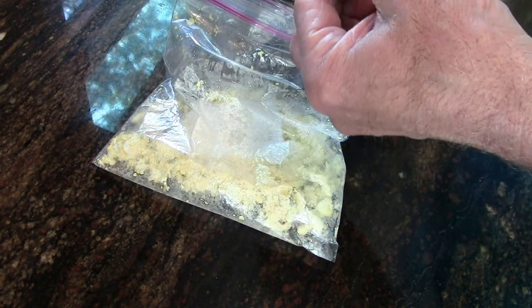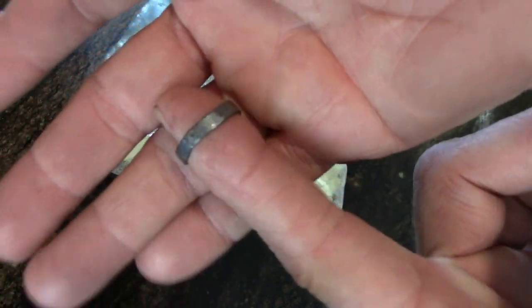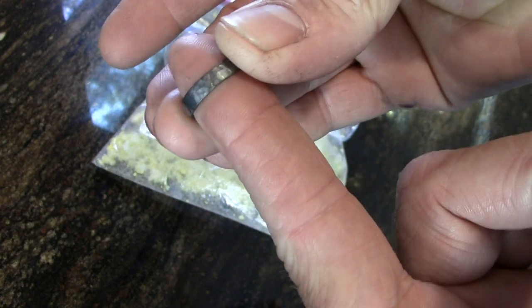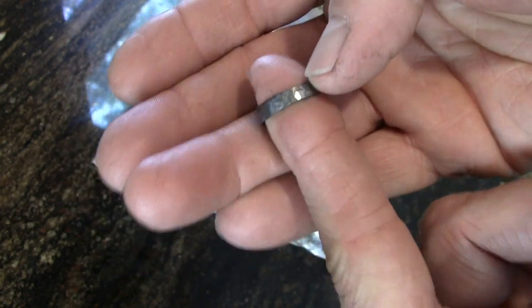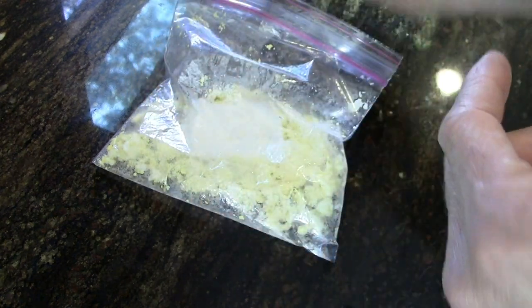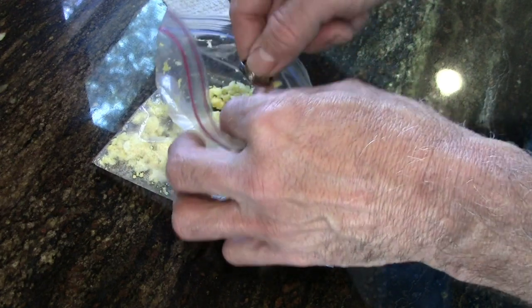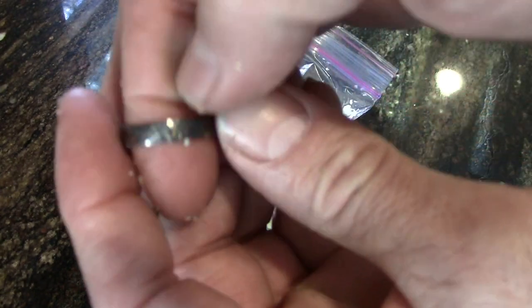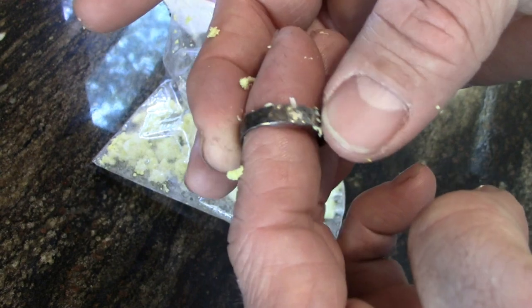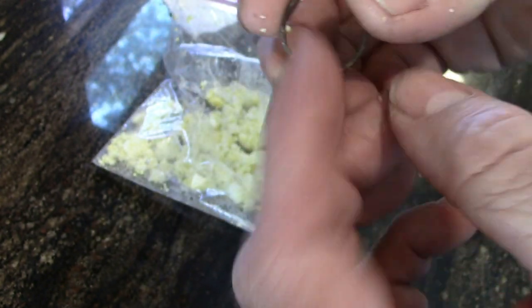Let's look at the ring that's just sitting in the vapors, not actually touching anything. It's gotten quite dark, and it's mostly a bluish kind of patina. I'm not sure how deep it goes into the metal — if I was to buff this, I don't know how easily it'll come off. Now let's look at the other one. I buried it back into the egg and it's been sitting about an hour. It's gotten dark as well, but it's a little different looking — kind of some reddish tones and that bluish tone. So wherever it's in physical contact, it gets more of the red and blue intermixed, whereas if it's just in the vapor, it tends to look more blue.